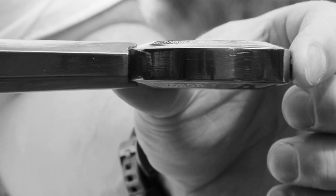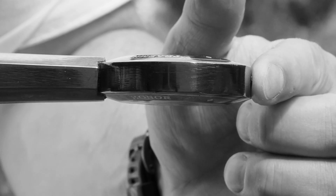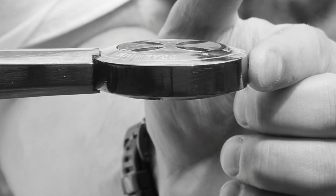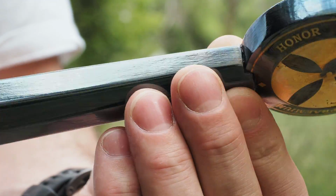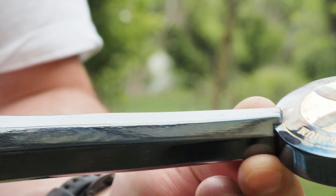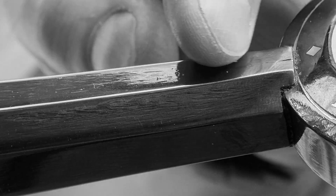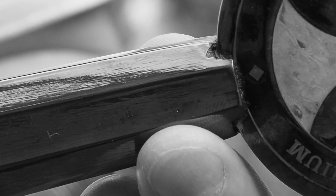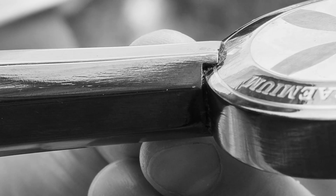At the same time, by having the pommel rest in these shoulders, it doesn't give it an opportunity to twist around at all. So where I was concerned about having a relatively small and perhaps weaker than it could be peen, these shoulders really keep the pommel locked in, and it's going to keep it from twisting around or loosening, or at least make it a lot less likely. So I don't see it on the initial design from Swordfriend Daniel, but if this was an audible called by Purna, then I happen to like the execution and how it looks here.